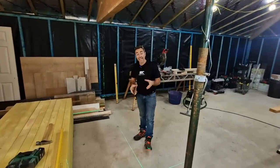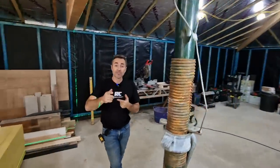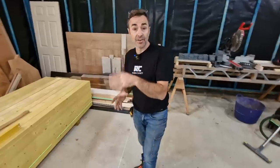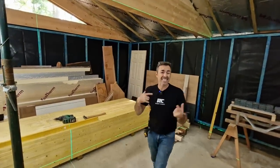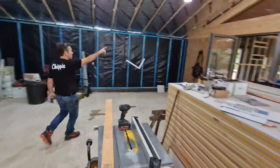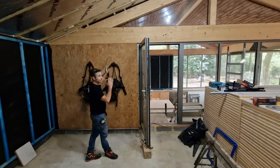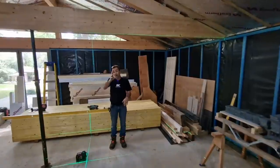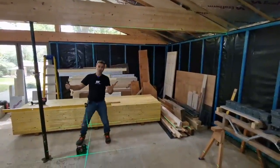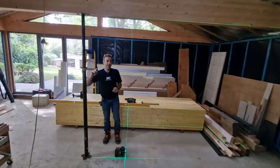With all stud work you have to have a start point. In our case we have a wall directly beneath this glulam beam — when I designed the roof structure we always factored in to have some support under this, so I can't move it. It basically mirrors the section of wall underneath the glulam. Instead of having the wall we already built in here, we designed this wall to be here as a division wall. We're using a post on the corner of the wall so the plaster comes in and keeps that glulam theme — wherever you're travelling you're following a glulam beam.